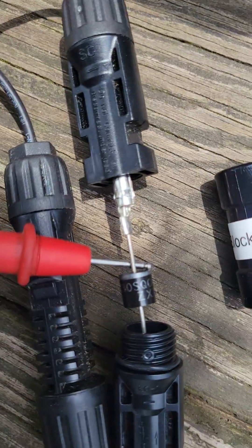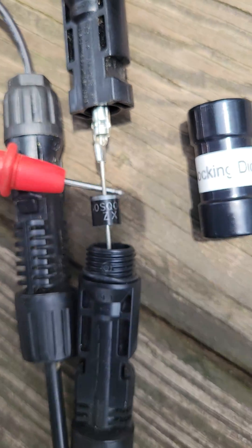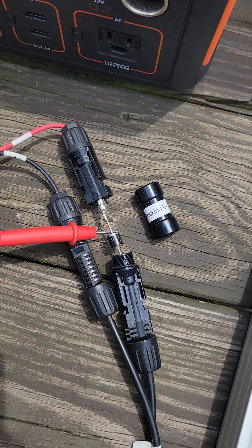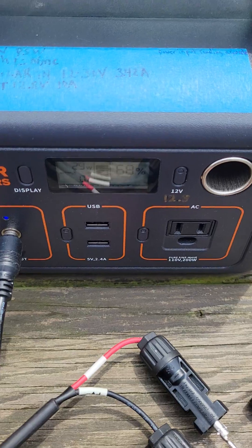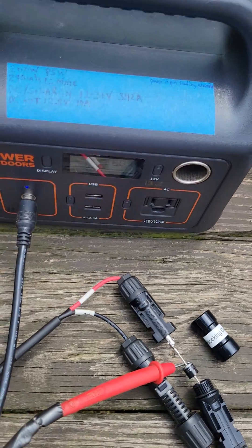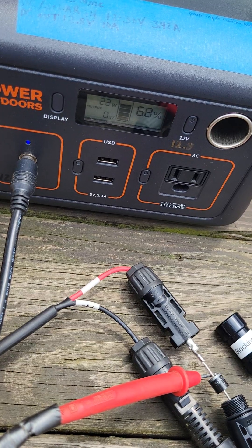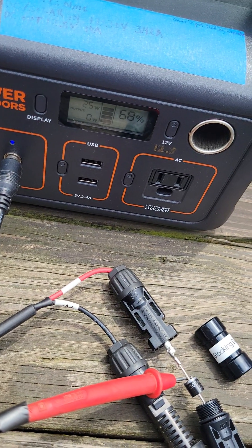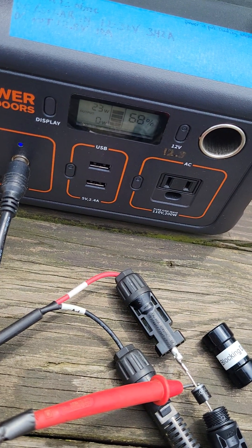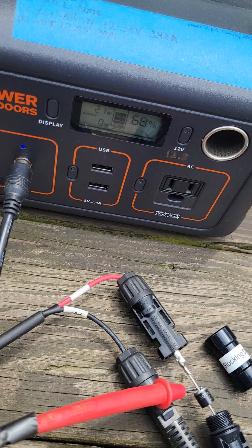This diode is a 30SQ045 — that's a Schottky diode. It's giving me a voltage drop of about 0.8 volts. And you're dealing with something like about 30 watts right now, so that would be at only about 1.5 amps. This solar system might go up to something as high as 5 amps, so when the sun comes out full blast I'll see if I get a different voltage drop. According to the spec sheet, there should be something like 700 millivolts or 0.7 volts of drop at 30 amps.